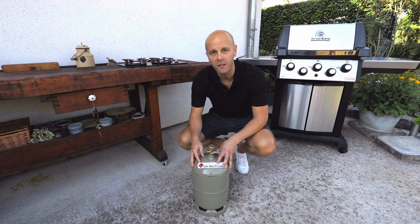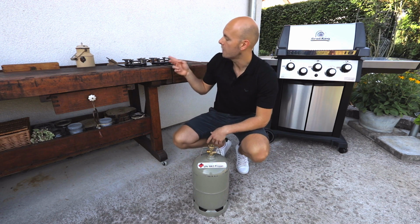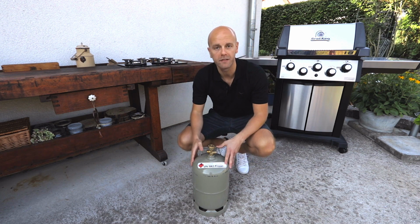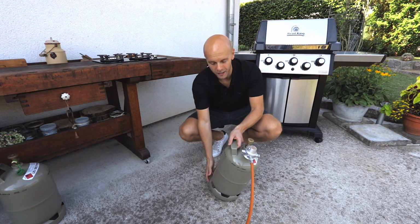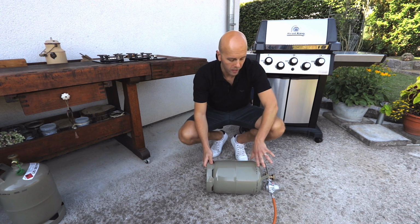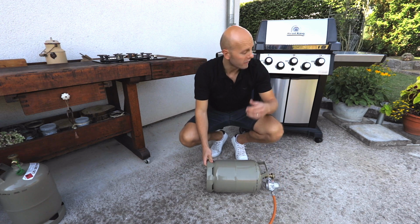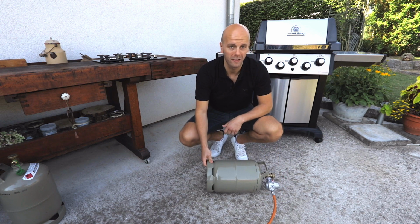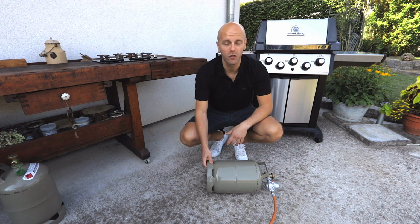This gas cushion can be used to supply equipment like gas grills, gas cooktops, or even various other gas-powered appliances, for instance. It becomes problematic when the gas cylinder is lying down, and not only is gas taken from the gas cushion, but liquid gas could flow through the gas cylinder valve into the line, and ultimately to the gas appliance. This can cause significant harm to both the hose line and the gas appliance, and in the worst possible case, also to people and the environment.